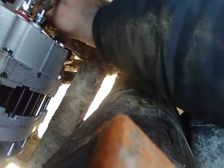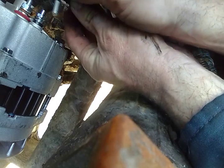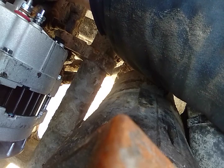All right. Now I should be able to get the rest of it on my hand. On my fingers, that is. All I'm doing is taking the bolt loose, or taking the bolt off so I can put the ground strap on the alternator. Here's my ground right here, and here's the new bolt I just slid in the eye hook, whatever you want to call it, the eye connector. Screw it back on by fingers until we can't do no more, and put the ratchet back on it, snug her down.